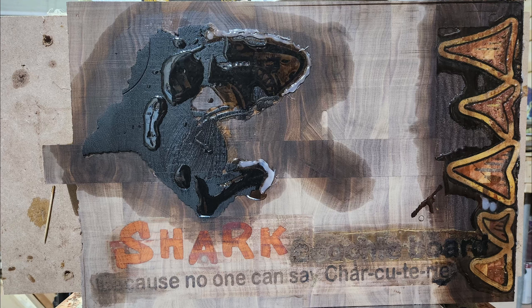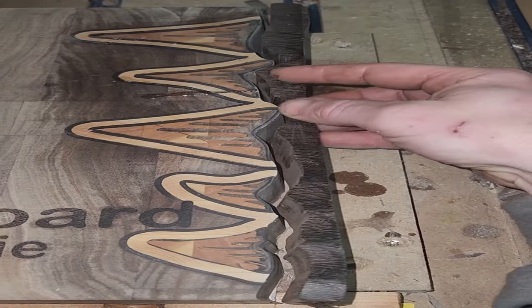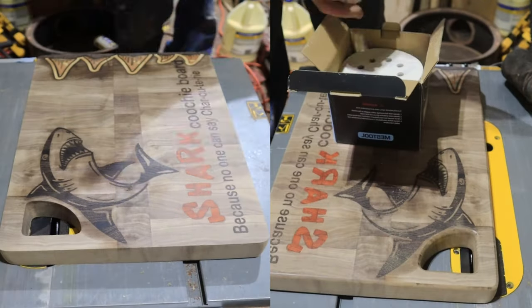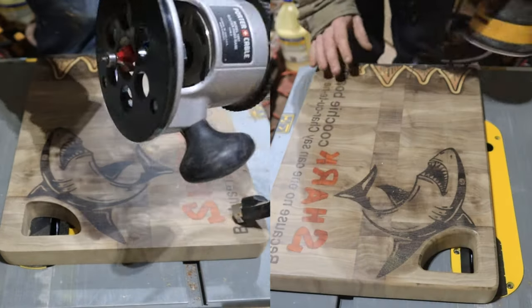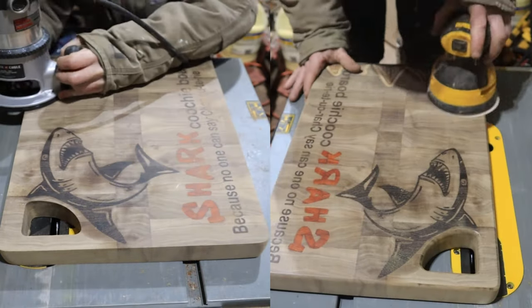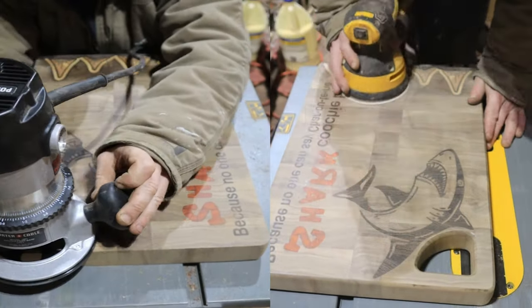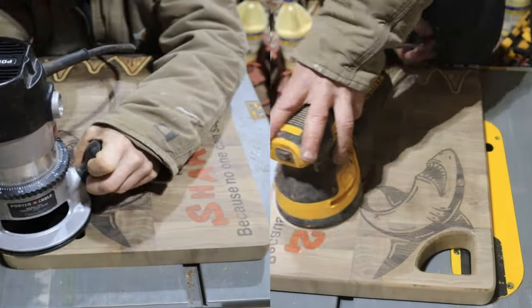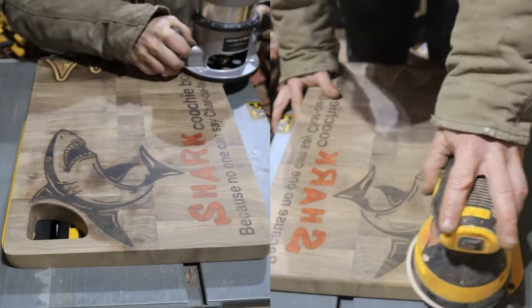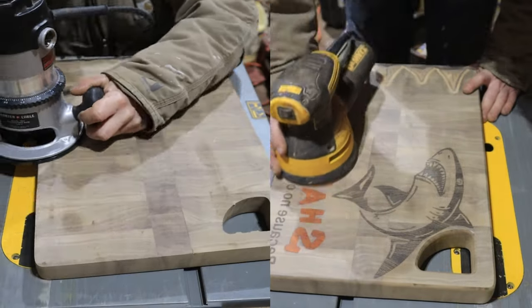Oh, and by the way, I also had a huge weather change. I started this board in New York in October, so warm, 60-ish. But by the end of that final week, it was about 20 degrees. So yeah, I definitely also experienced wood movement. Initially, starting off, I put that black walnut cutting board on my CNC and leveled it to the spoil board after coming out of my thickness planer, but since my final glue-up made it over 12 inches, I couldn't do that final pass on a thickness planer, so I leveled it out.